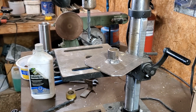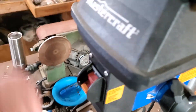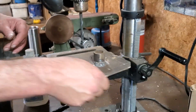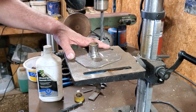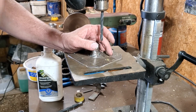Little tip — just drill a little hole in the corner there. Make sure it can't interfere with the pulleys in there and you've got a good place for your chuck key. It never comes out; it's easy to get in and out. Okay, so what do you think — is it wobbling, Joe? I think so. It's off center. Yeah, that will never work.